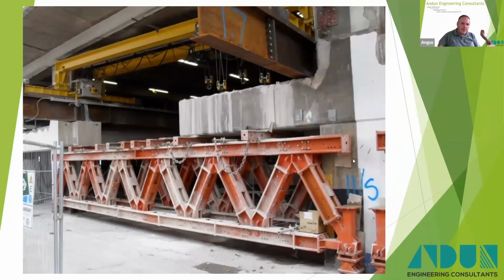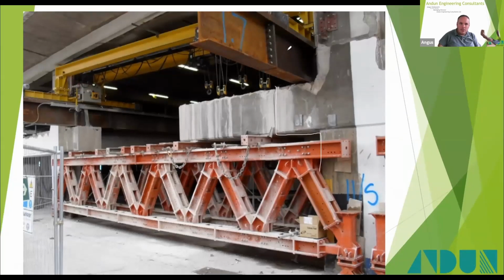There's another nice little view. And again, because the floor below was quite a low capacity, we couldn't prop the beams down to the floor below. We had to put these trusses in that allowed the beams to be sliced up and then lifted out of the crane. And you can see what I was talking about there quite nicely. You can see the stub of the concrete there that gets left in place, on which the crane rail sits, and then these get taken out after we take the crane rail back out.